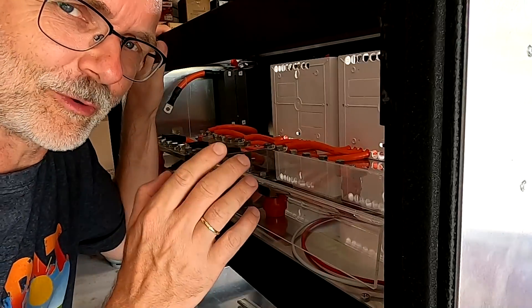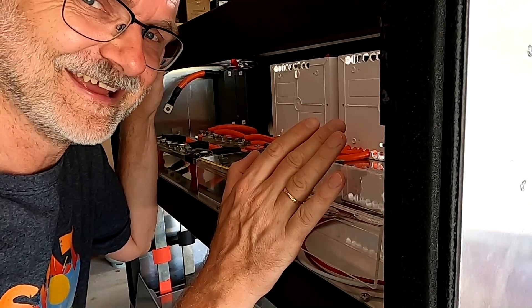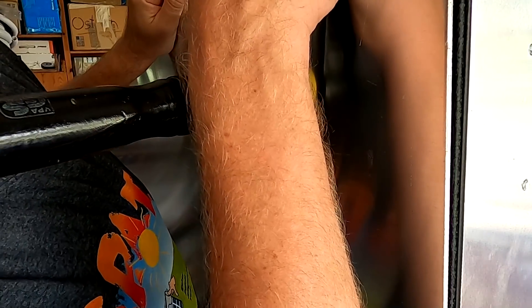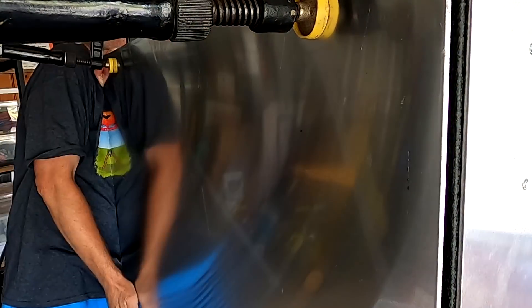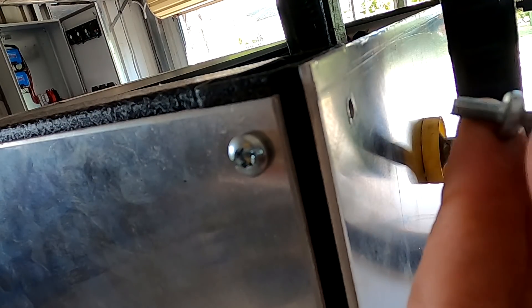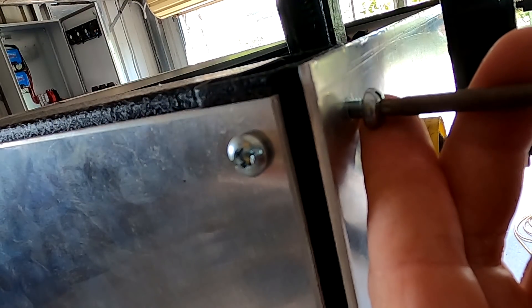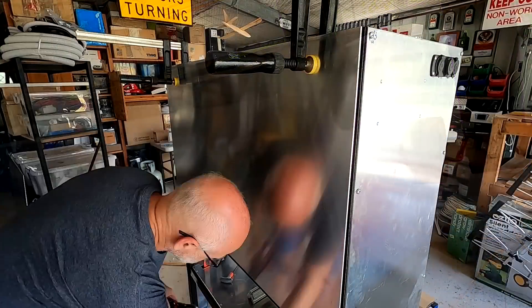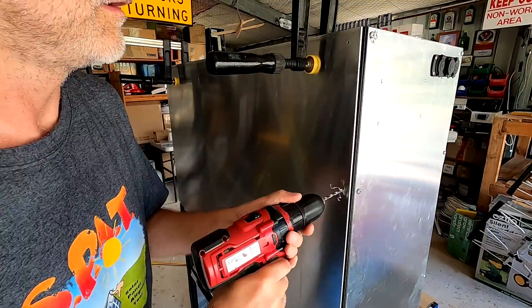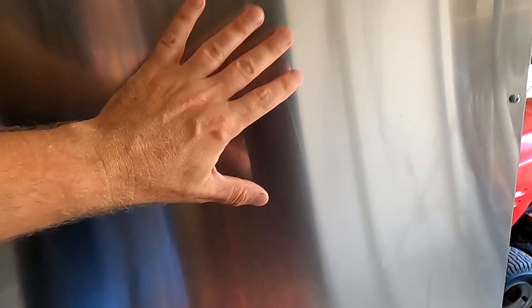Months ago I thought about putting this beam back in and now it's the day - merry Christmas Andy! I need one more hand. I'm using these self-tapping screws for these holes here - you drill a four millimeter hole and then use these screws and they tap an M5 thread into the hole automatically. These few screws are definitely enough to hold this panel here in place.